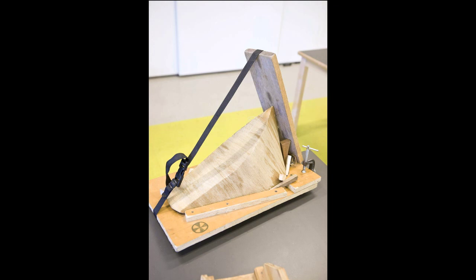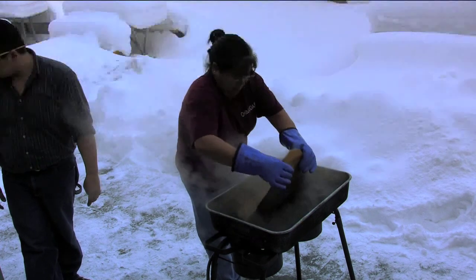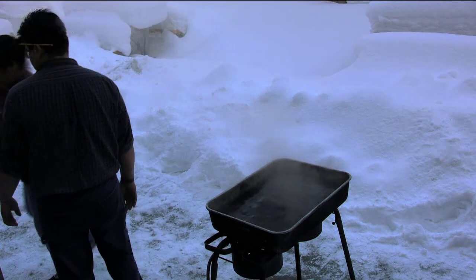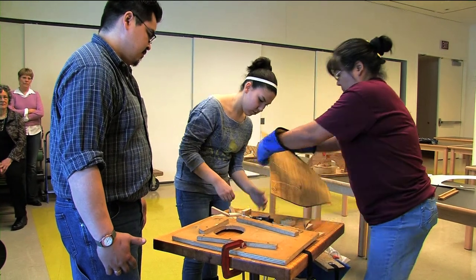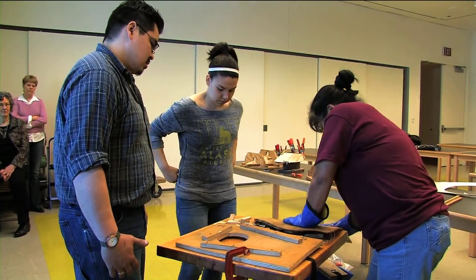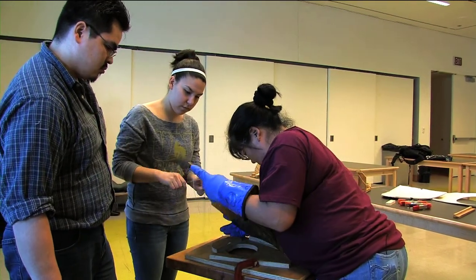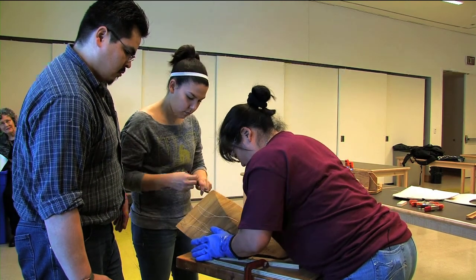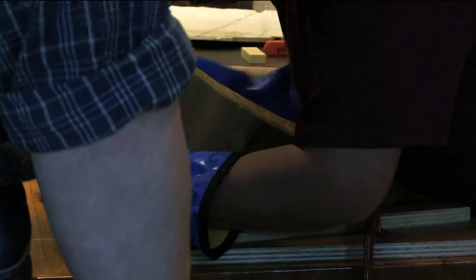For the full crown — the chief's hat — we clamp this to the table and get it ready for steaming, which only takes about 30 minutes in the water. When the hat is brought in, the person bending it should wear an apron because it will be hot. They take the hat, bend it on the corner of the table where the bends are, then come and insert it in the jig and hold it until the helper comes.